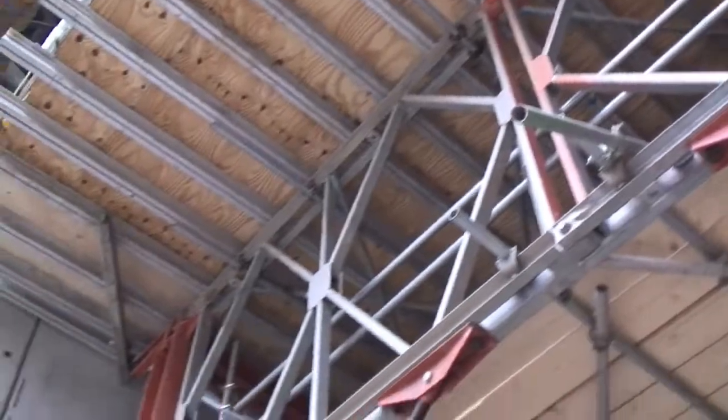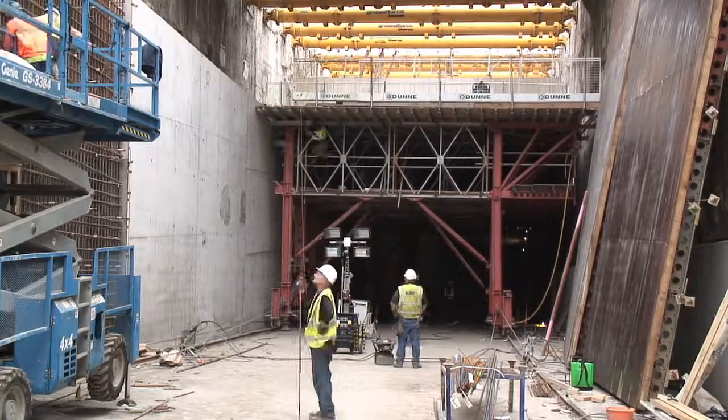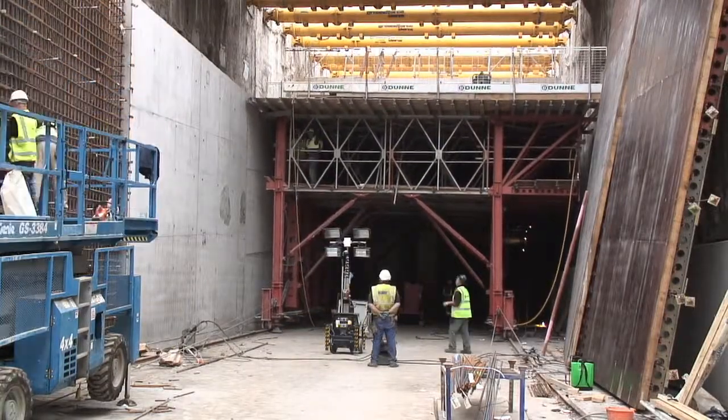So far we've cast four roof slabs. There's no messing about. The system's on rails — you release it, pull it forward, jack it up again and that's you ready to roll.